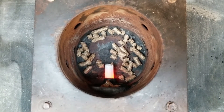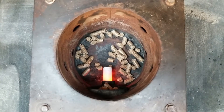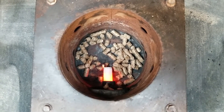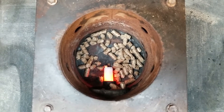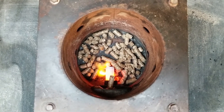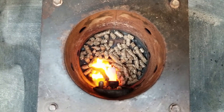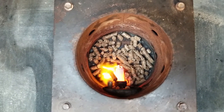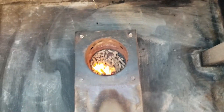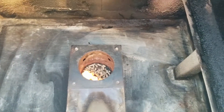It needs a little bit more fuel. So when you vacuum these things out or change pellets, you kind of vacuum out the auger tube a little bit — there's no pellets left in the pot, so you're kind of starting from scratch. That thing seems to be just igniting them, just by the infrared coming off it. Look at that, that looks pretty good. It's only about a minute, maybe a minute and a half. That's pretty much what we wanted to see. I'm going to let it run a little bit, but I won't keep my phone in here and get it all smoky — we'll check back in.